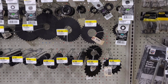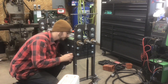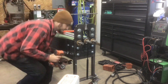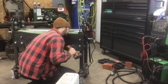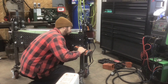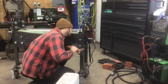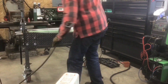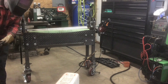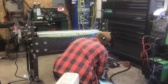I went up to my local farm store and picked up some sprockets and hubs that I could slide onto the ends of these shafts to make this a powered unit and make both bottom rollers move at the same time. I built the cart separate from the roller itself, so I needed to make some tabs that I could bolt to the roller's existing bolt holes and then weld onto the cart to keep them as a solid unit. I cut those out on the plasma table, bolted them to the existing holes, and welded the sides of those plates onto the cart on all four corners.